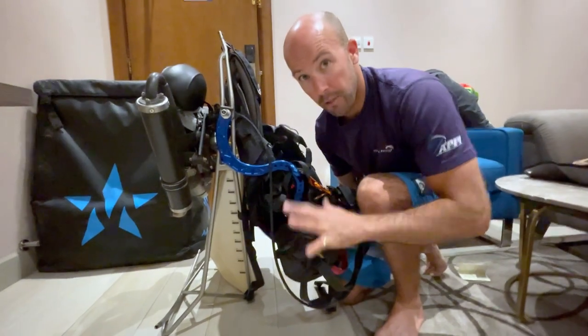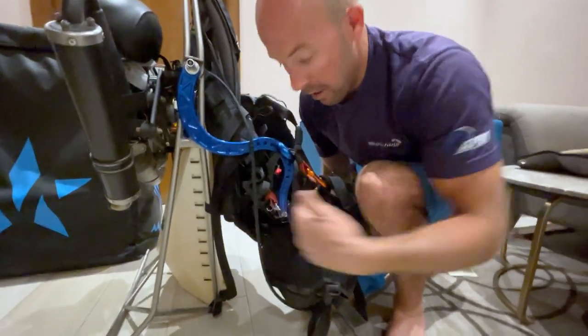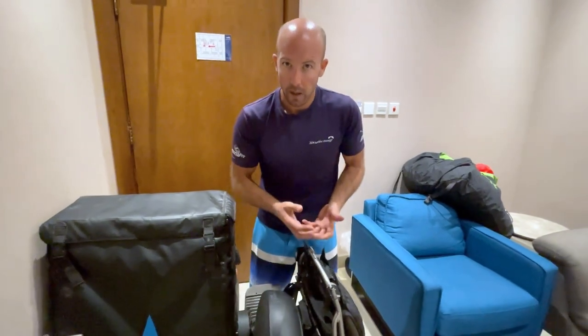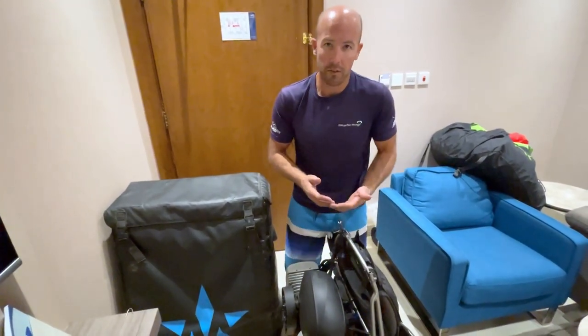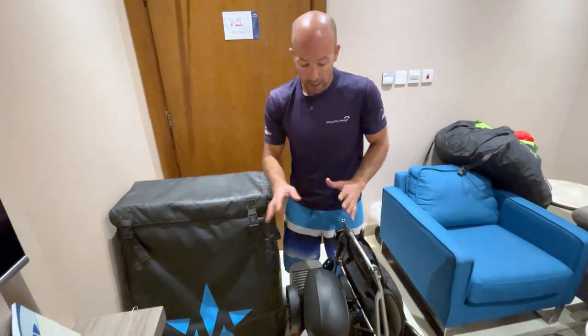On this harness you can actually unzip it and take off the velcro and just put it in a separate bag. If you're struggling to remember how to take all this off and put it back together, one bit of advice is to film and video the paramotor before you take it apart, then refer back to that and almost reverse-engineer it to put it back together as it should be. It is fairly simple but quite time-consuming — it will take you maybe an hour to get everything prepped and ready.